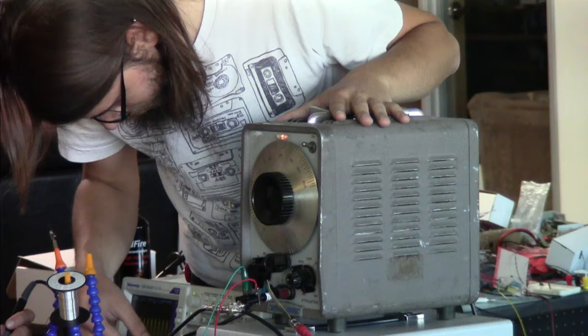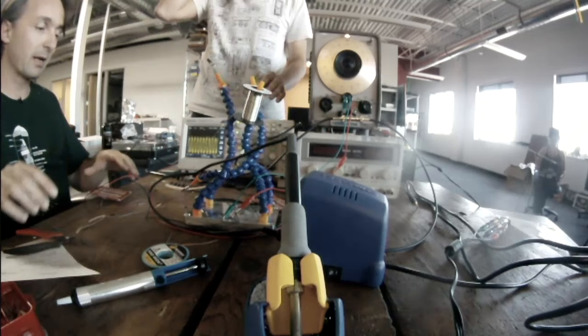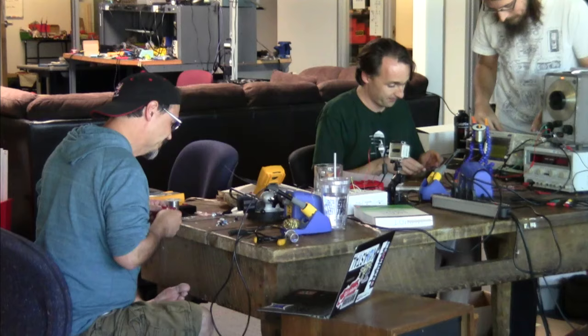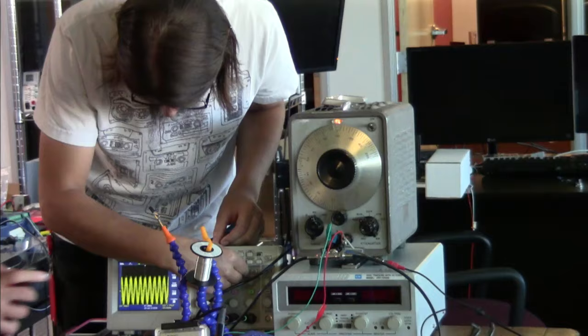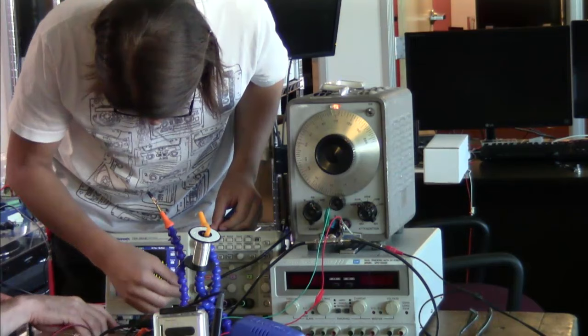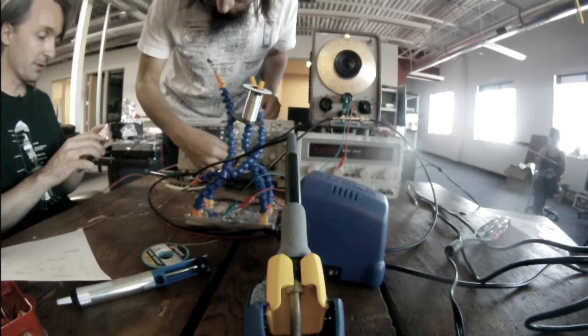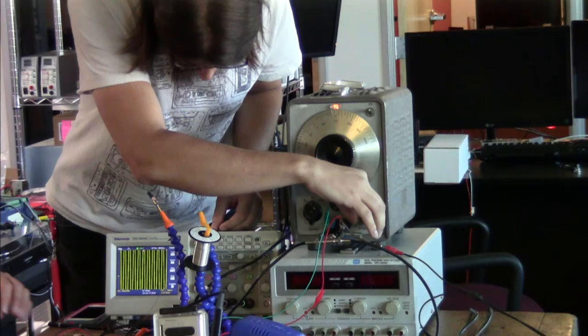And it's worth mentioning, I'm saying that's a good place to start because the RIAA preamp, that long slopey curve, is actually specified in terms relative to the 1 kilohertz measurement. And also worth mentioning, in that table Marshall was just looking at, telling us 5 millivolts, for real world signals 5 millivolts is tiny and pretty hard to deal with, pretty hard to take any distance. So we really want to bump that up to something bigger before we try to do anything with it.